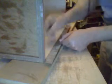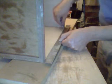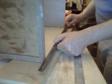So what I do is I take a long straight edge, a stainless one, place it into position and trace a line. This is at once also our reference line, so we know where the hinge has to come, till there and no further. Yeah, it's good to know that we have a reference now. I place my plywood back into place the way I want it to be, and the reference line is now very useful in order to know till where it has to be cut away.